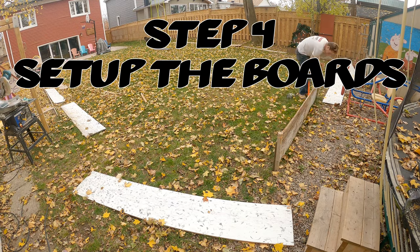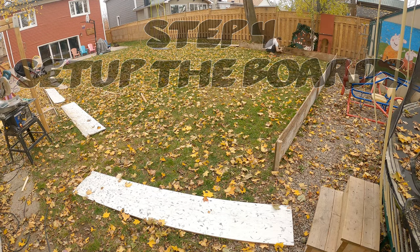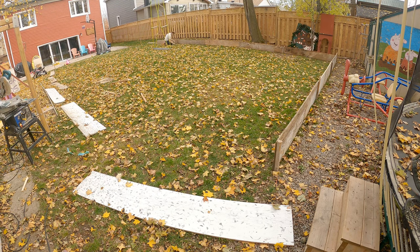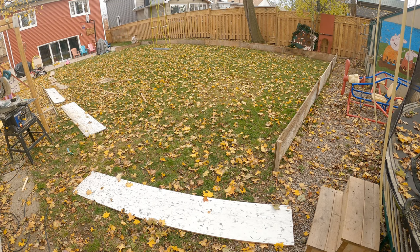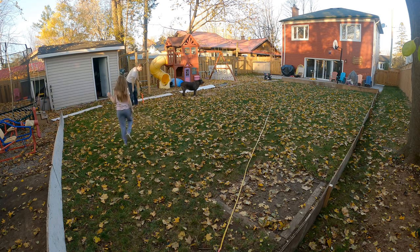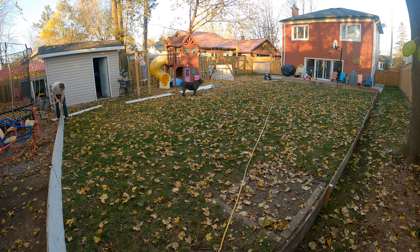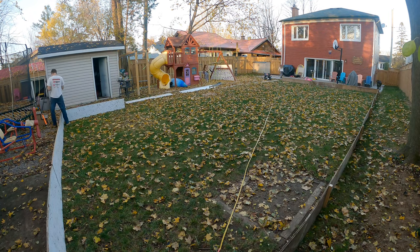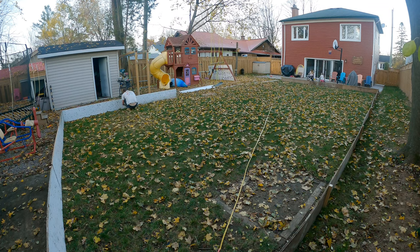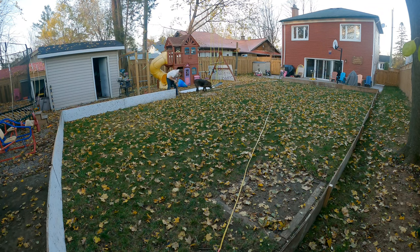Step 4: put your stakes in the ground and screw the boards into them. Some people build a 2-by-4 frame and screw the plywood onto that — solid and long-lasting. Message me if you want those steps. I personally just use stakes at the end of each board and one in the middle, with a line to keep it straight. In deeper areas, add a couple of angled stakes for extra support. I've used the same boards for 6 years. Just note: if you don't set up in fall, pounding stakes into frozen ground will ruin them.